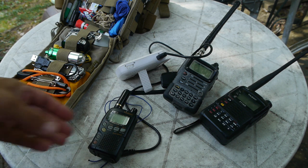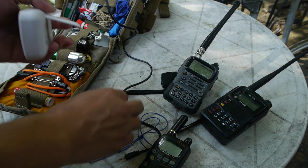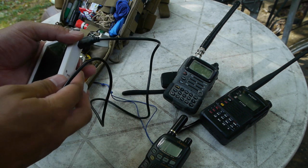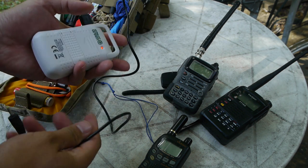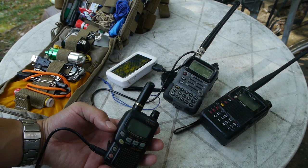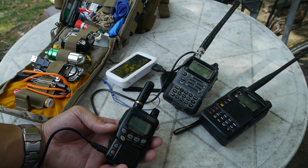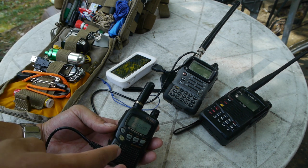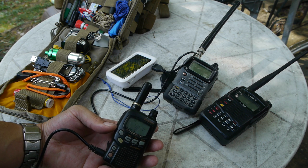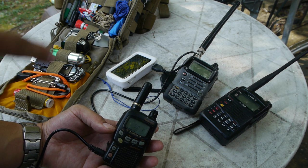The reason why I like this radio is that I can power it via that port using a USB battery bank, with a small conversion cable from USB to DC — you can find this cable on eBay for about $1.25. When the radio comes on you'll see a voltage meter showing approximately 4.5 volts, which means the radio is now running off that battery bank instead of the internal battery. You can check it in the menu under bat: it shows 4.6 to 4.8 volts, floating up to 5 volts. So the radio is operating off the direct current of the USB battery bank.